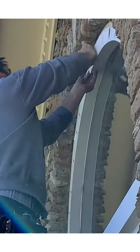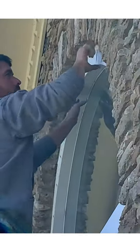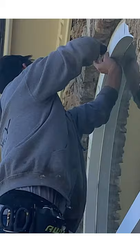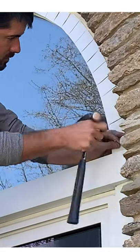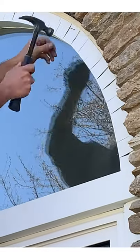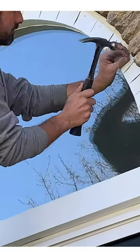I'm kind of pulling to my right here to get it tight against the stop that's holding the glass in. We want it to be nice and tight because you can see this from the inside — if you're not tight up against the window stop, it shows a light on the inside. So you want to make sure your metal is sitting tight against the window glass stop.